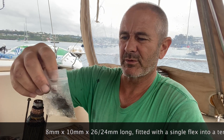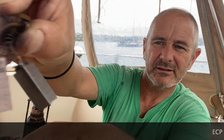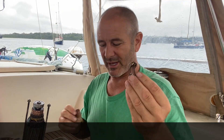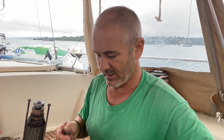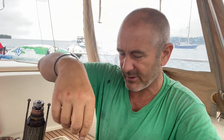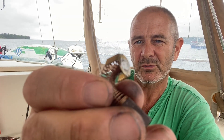Luckily I've got some replacements — that brush is broken and the other one doesn't look like it's far off. I got some replacements from a British company called ECP, back in the UK, and they have exactly the brushes I need. It's got ECP M13S written on it. The brushes come in all shapes, sizes, configurations, and materials, and it's really hard to get a match sometimes, especially for these old motors. There was another company in Belgium or the Netherlands that were almost a correct match — the brushes were the right size, but the end pieces weren't, so I would have had to solder those on.